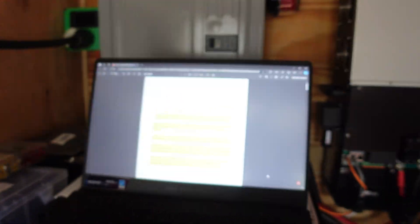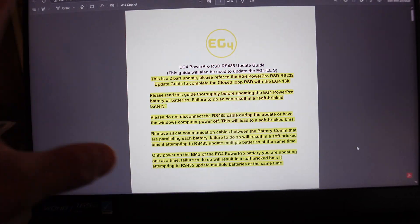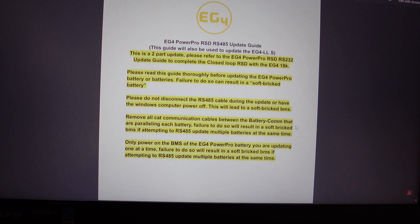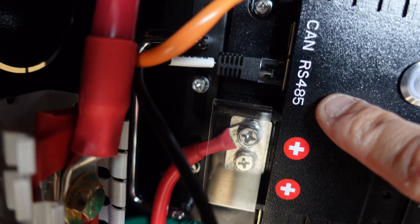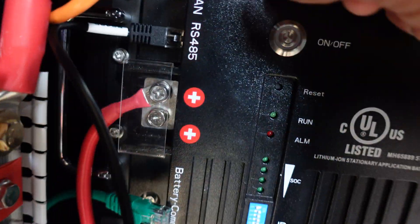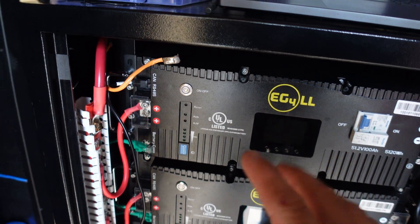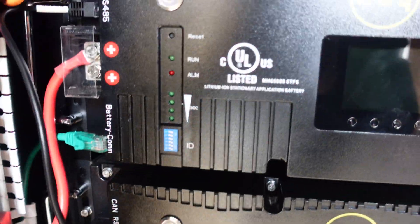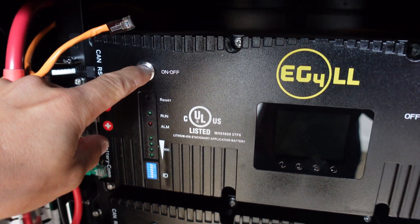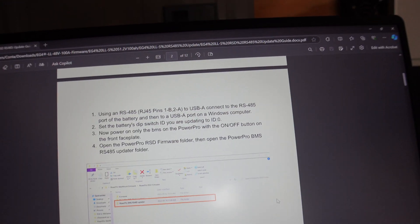Let me get this cable hooked up to the computer and then we'll go through it step by step. Like the last video I did on the other half of the batteries, I will leave a link to this firmware and pamphlet in the Google Doc in the pinned comment and in the description below. I got it plugged in here USB, with the Ethernet port plugged into the RS-485. I disconnected the battery comms and the CAN that communicates with the inverter 6000 XP. I need to switch these switches all the way over to the right side — that is ID0 or ID64 in the book. Now it says connect to the RS-485 port in the battery.